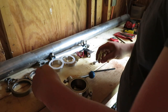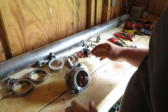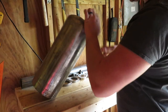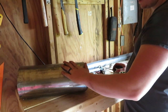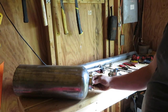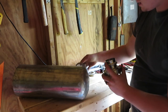So I can show you a little bit of how it's going to work. Basically, this here is going to be our compressed air tank — a.k.a. the fire extinguisher that we sanded down and cut a hole in. This here is going to go right like that and we're going to weld it. Then this goes here and there's a little O-ring that's going to keep this all nice and sealed — just like that.